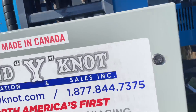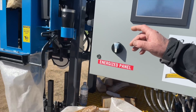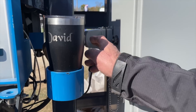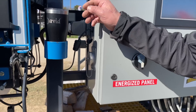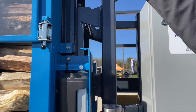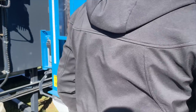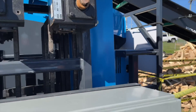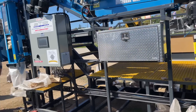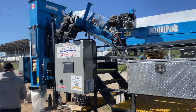The head is interchangeable very easily. Unplug these two wires, pull these two safety pins — there's a spreader bar that goes on top. You lift this up, take it, and set it on the empty rack on the other side. Take the next one, put it in the spare rack, take the spreader bar off, hook it onto the new head, pick it up, slide over, set it in place, put your safety pins in, put your two wires in, push one button on the screen, and you go to work.